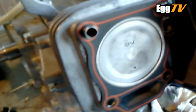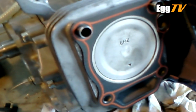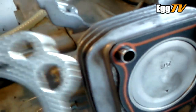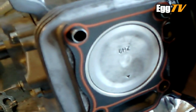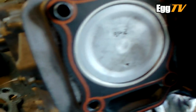I got it from a kart shop on eBay - a UK kart shop or something. Anyway, the thickness is very similar; the uncompressed thickness of that is pretty much equal to the compressed thickness of the old one. So hopefully I should get a smidge more compression with it being a bit thinner when it's compressed. It's got a nice little sporty-looking bead in for extra sealing.